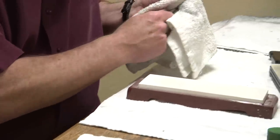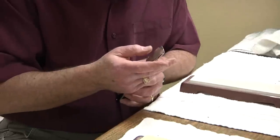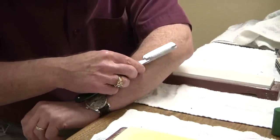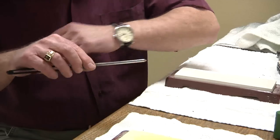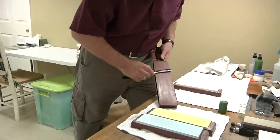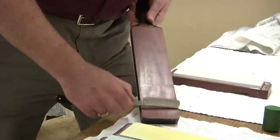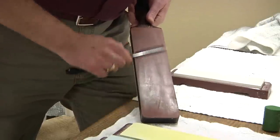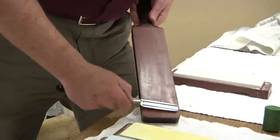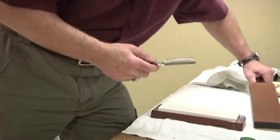After doing 6 or 7 strokes on the stone and 6 or 7 more on the diamond, I wipe it off and I'm ready to just strop that razor once again for a regular stropping. From a thumb pad test with what I've done there, I've actually notched this up a little bit from where it started. I could also look to cut hanging hairs — which it's obviously doing. For purposes of the video I'll use the paddle strop this time, doing my normal 40 to 60 strokes, whatever you use on a typical daily basis, and then test shave.